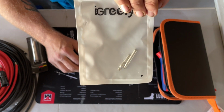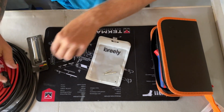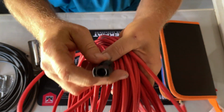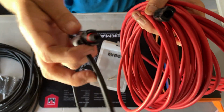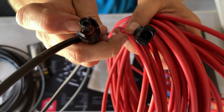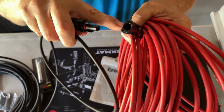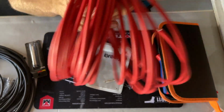And these are the connectors here. And there's two different types because they basically slide into each other. If you look at the two here with this positive, if you can see in there, you'll see that it has the pin type of connector. And here we have the female end or the shaft internal to this. So this plugs into here, but the connector inside of here actually slides inside this connector. So you always want to make sure to match your connectors up right.